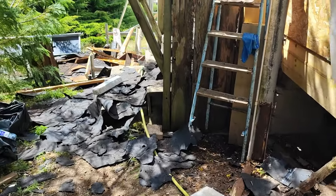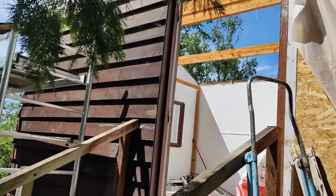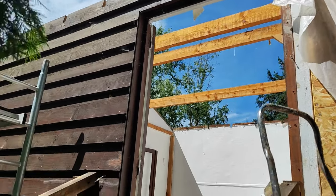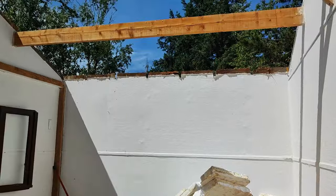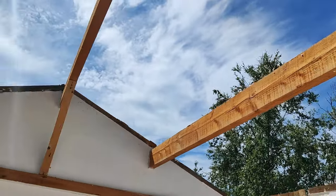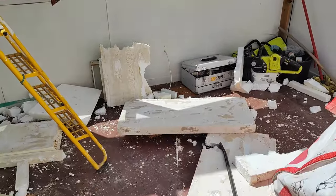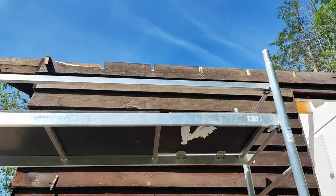Destruction day — it's been a very successful morning. We took off all of the old shingle tiles first and then got all the big rotten chipboard roof panels off from the outside, with me inside and Jo on the outside. We've also taken off all of the middle supports — called chevrons in French. Now we have a beautiful blue sky and the structure, which mirrors what we've got on the other side. The new roofing will be attached directly onto these, extended a bit at the front. I'm amazed at the progress we made in one morning — magician demolition. Everything is now on the ground.